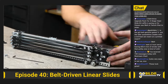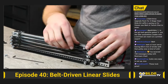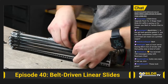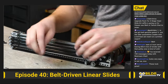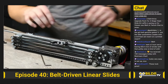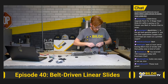One downside of belt compared to cable is you always have the potential to skip a tooth, which means your encoder reading may not be accurate to the end stop. You can get it tight enough that 9 times out of 10 it won't be an issue, but it's always a possibility. We'll tighten this down, attach the loop using the quick method, and cut the excess off — though this much excess would run into the bearing on the next stage, so we need to cut some off. We can now hook this up to power with a servo commander, a 1×15 motor controller, and a battery.